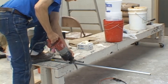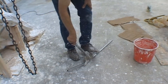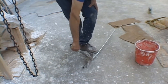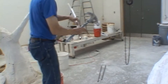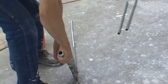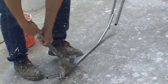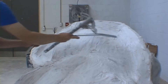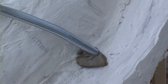The burlap gives strength to the plaster so that the shell will be strong and will last a long time. After our plaster shell sections are complete, we add additional reinforcement in the form of electrical conduit. Take your time using a pipe bender to bend the conduit to conform to the shape of the shell. The conduit pieces are held in place using small pieces of clay until they are locked in place using plaster and burlap.